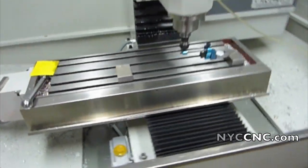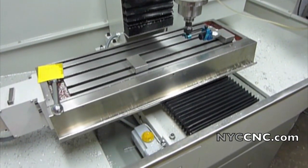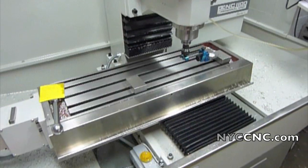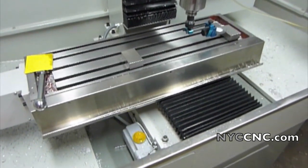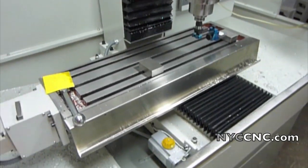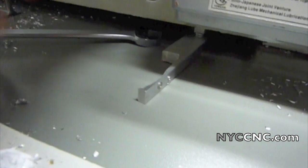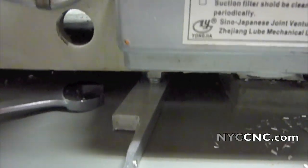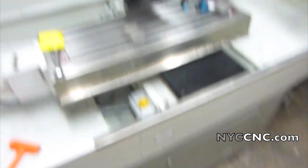What I had read is that you need to adjust the way the mill rests on the stand by shimming it. The reason I'm so excited is I really wasn't looking forward to this, thinking it was going to be a daunting endeavor. But the method I read about to lift the mill up in each corner is by taking a half by 13 inch bolt, cutting it down to size, tapping it into a piece of aluminum, and then using a wrench to lift the bolt out of the aluminum — and it lifts the mill. It's actually really easy.